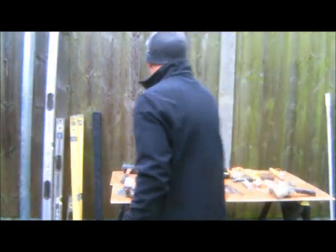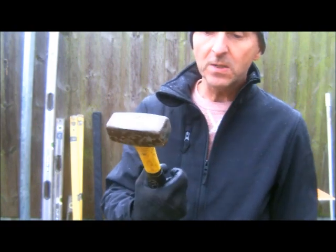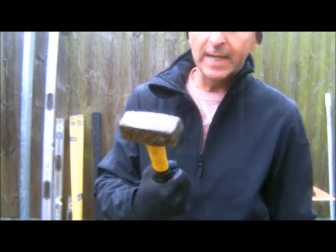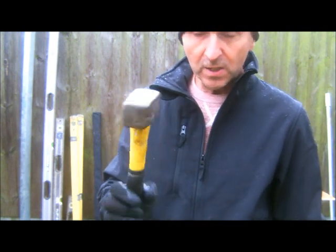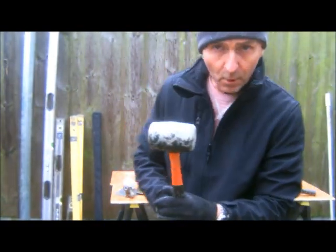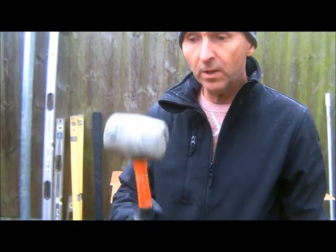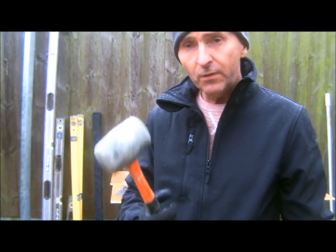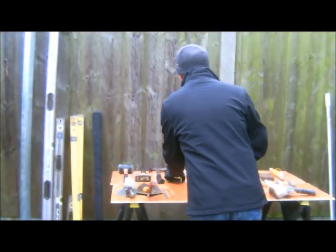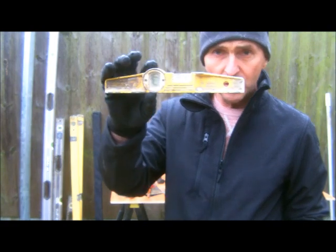A lump hammer or club hammer — I find just the two and a half pound is much better for repetitive work. So if you're using it with a chisel chopping out, this is just the right weight, and again when cutting bricks with a bolster this is just right for me. Finally in my bucket I have a third hammer, which is my mallet, mainly used for thin joint block work — watch the first three thin joint videos to see it in use.